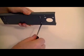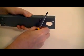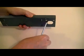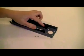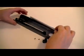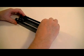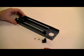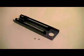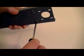Undo the two bolts and nuts to release the fourth shaft fixing base from the Y-gantry bottom cover, then put these aside. Slide the second Y-shaft through the Y-axis linear bearing block and into the socket in the second shaft fixing base. Refit the fourth shaft fixing base to the end of the Y-shaft. Secure the fixing base to the Y-gantry bottom cover with the two nuts and bolts.